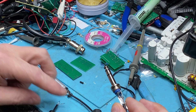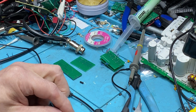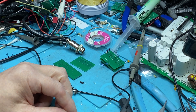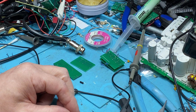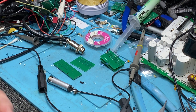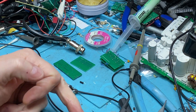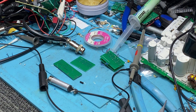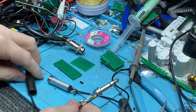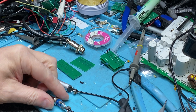Anyway, with these connectors, this is the way I'm doing mine. This is pretty flexible cable — actually used on headphone interconnects left to right in the band, but I'm just using it here. I've seen people cut bits of rubber and put the rubber in with the wire through it and all sorts. But the quickest and easiest solution, which I've just been doing lately and never had a problem with, is our friendly hot melt glue gun.